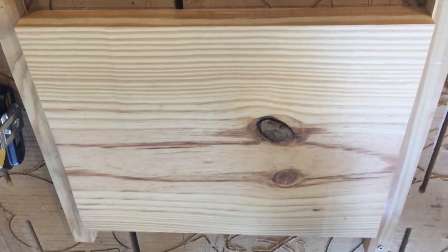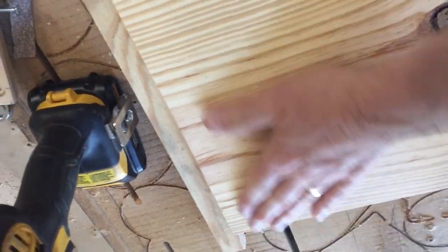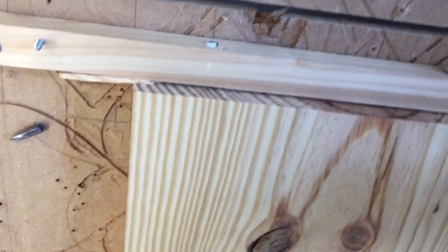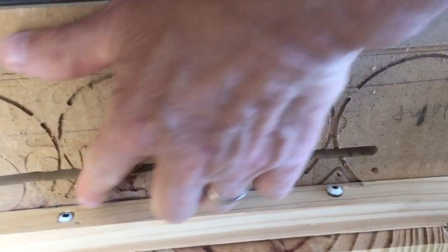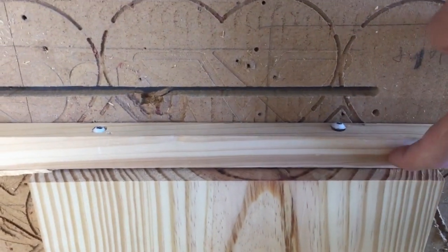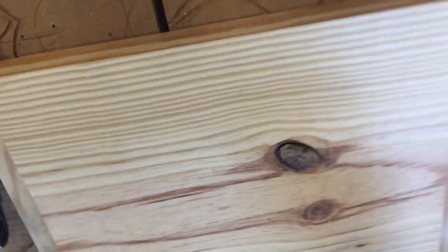The mounting for this plaque is a little different because the whole surface is machined away, so I have nothing to clamp to. What I did is clamp a board here and here so it's square — I took my laser and burned a line down there so I know where my cutting surface is, my X and Y plane. I'm going to screw here and here, and one through the table on each side to hold it. This will keep it from moving. When I cut a little bit beyond this edge, it will cut on the clamping board and not hurt anything — that makes it safe to cut.